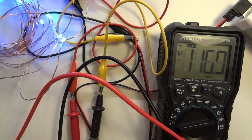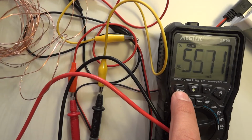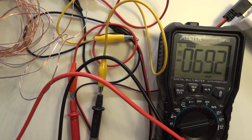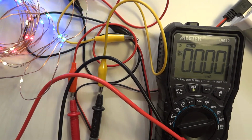So this is constantly blinking, and you can say the power draw is actually AC. I can measure this a little bit, because it changes very frequently. And let's see, these are the other modes. This is the fairly quick blink. So maybe in the AC mode I will have something. Yeah, as you can see, up to 60. So it runs only half at one time, and that changes quickly and so on. So at full brightness, this whole circuit takes 120 milliamps.